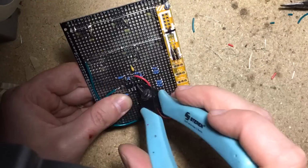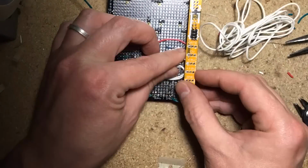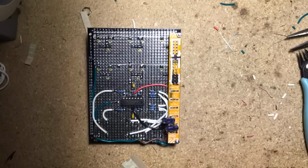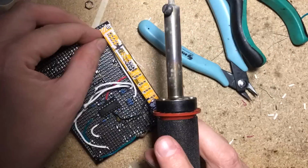Again, use your meter a lot to check that your connections are solid. I made an annoying mistake. I connected the inputs straight into the circuit, forgetting all about the volume pots. So I had to remove all those cables and route them correctly through the six pots on top.